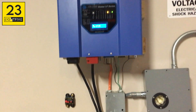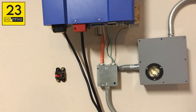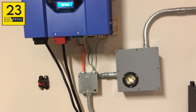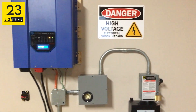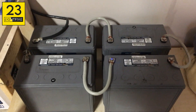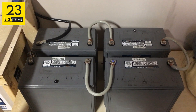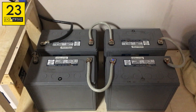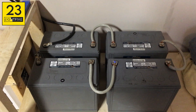The output from this inverter goes back through this box on 10-2 wire that's then fed to the wall back to the transfer panel. This is a 48 volt inverter, so I've got a 134 amp hour 48 volt battery bank sitting here. These are AGM batteries — absorbed glass mat batteries — so they don't really need any maintenance.